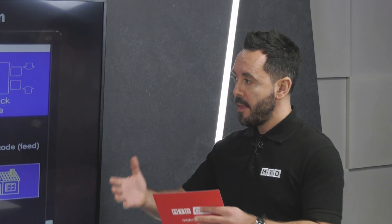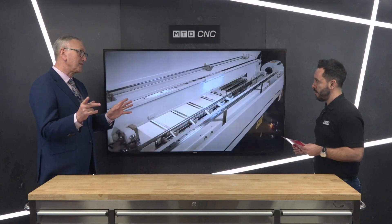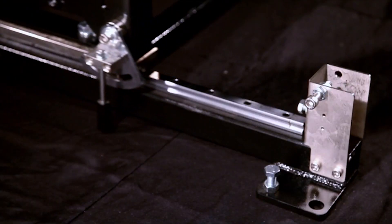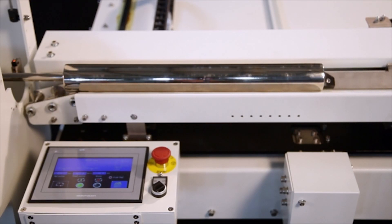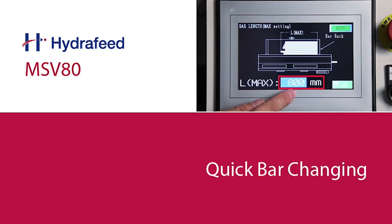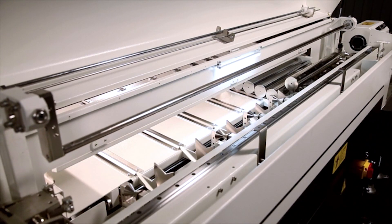Is there still a big market for short bar feeders in the UK? Absolutely — and let me make one thing clear: you don't have to have an electro-pneumatic on a single spindle or vice versa. We put as many MSVs on single spindle machines as multi-feed type equipment. We're seeing our market quantity grow purely because the buzzword here in the UK is automation at any level — whether it's a simple short magazine bar feed, a full-length one, a robot, or whatever. The UK is grasping automation for obvious reasons. I'm seeing examples out in the field where we've got a short bar feeder on a multi-tasking machine with a robot in front of the door, giving complete flexibility whether working with bar or billet.